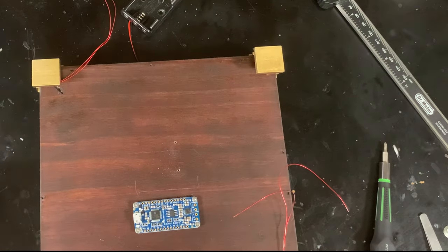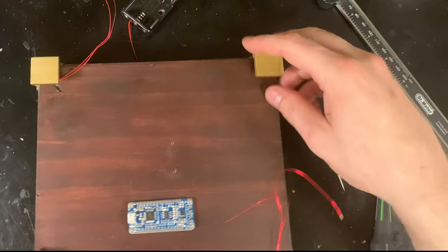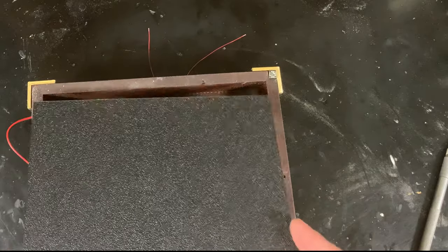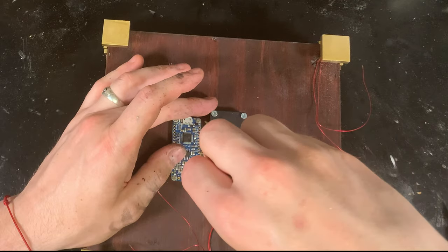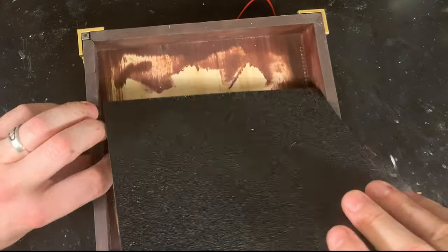You may be wondering how I actually cut the speaker hole — well, the wrong way, so I'm not even going to show you. Now that there's a giant hole in the box I'm going to cover it with a piece of HDPE — a sheet of plastic you can get from pretty much any hobby store — to give a nice flat rolling surface underneath the mouse pad. For assembly I used rubber O-rings as shims to stand off the speaker and get a nice flat surface on the other side. I mostly had the O-rings lying around and it seemed like a good use.